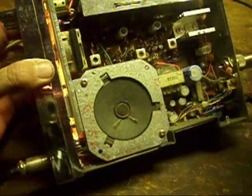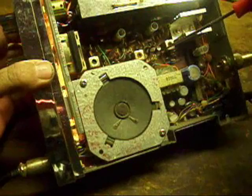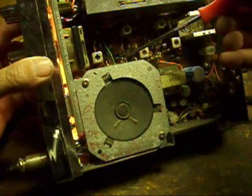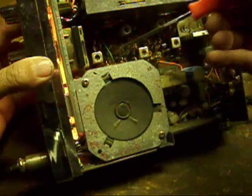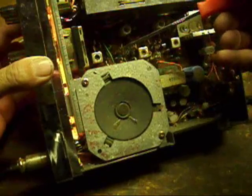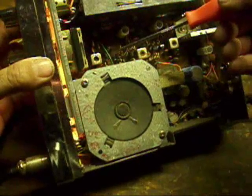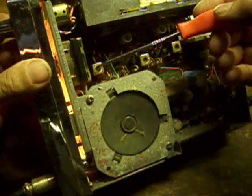On the receive stage, it is dual conversion in name only. You have signal coming in, TR switching, then the first 27 MHz tuned amplifier, a tuned circuit, amplifier stage, and the next 27 MHz tuned circuit. Then you have the 27 MHz signal and the 10 MHz signal injected in the receive chain almost one right after the other. There are no intermediary tuned circuits in between, so it's technically dual conversion, but just barely by the strictest sense of the term, because both frequency conversions happen in one stage.